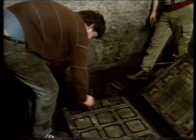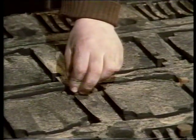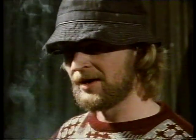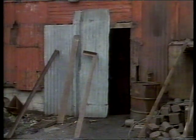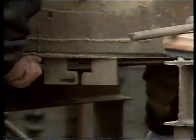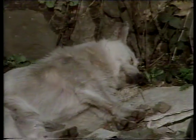The cores will occupy the space where hinges and keys will fit, and prevent the metal from forming there. These can only be fitted on the day of the casting and must be bone dry. If they take up moisture, they could cause an explosion within the mould during the casting. Poor old Patch has been run out of the shed for fear of him collapsing the moulds. The rats will have another day of peace.